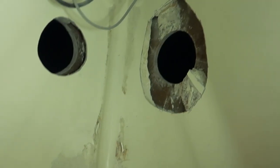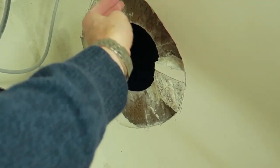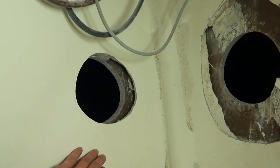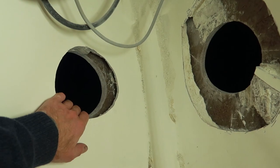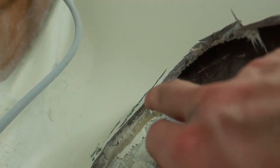The next stage of the day: I cut the two holes. I started grinding on the outside, just spending the time wisely while my battery is charging with the different tools. So two holes are cut. You can see more clearly the inner liner here — in the beginning it seemed quite thick, so I was briefly considering maybe laminating to it and filling the gap with thickened epoxy. But then I saw it was super flimsy in places, so the thickness is quite variable.